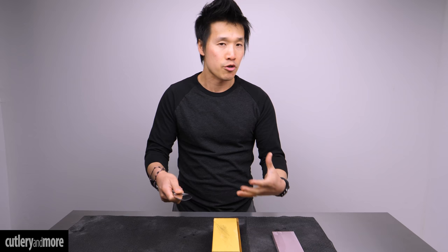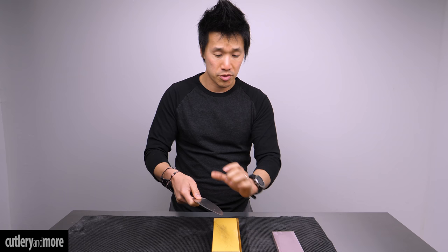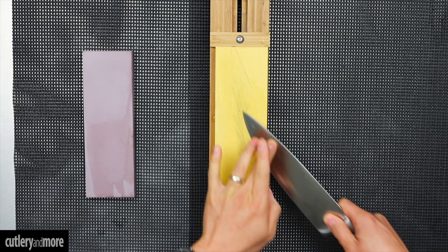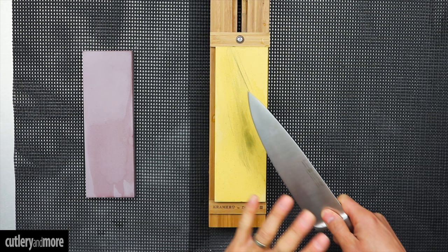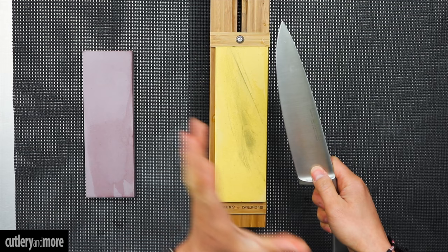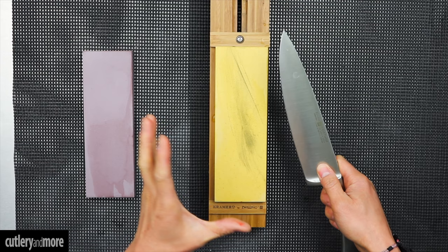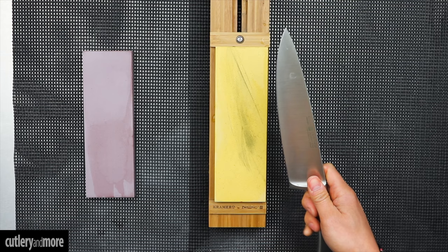The next method is what we call the crescent method. You'll see this used for knives with large rockers on their bellies — it's basically going from the tip of the knife to the heel in one motion and then coming back. This method is very efficient and takes up a lot of material per stroke, but the problem is you still have a bolster, and if you are not careful you can easily grind that bolster on the corner of the stone.